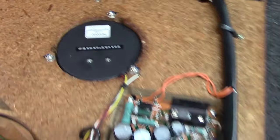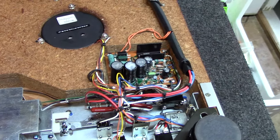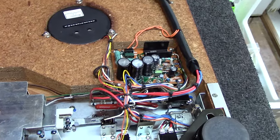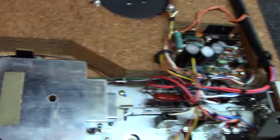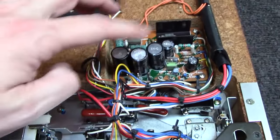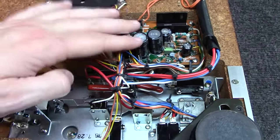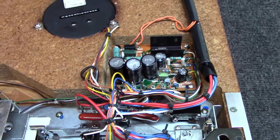The unit was made July 12, 1976 — so it's 40 years old at this point. My math wasn't doing well early this morning. But the point is: 40-year-old electrolytic capacitors — it's probably time for them to be replaced. So I'm going to get this board out, get it on the bench, and recap this thing.